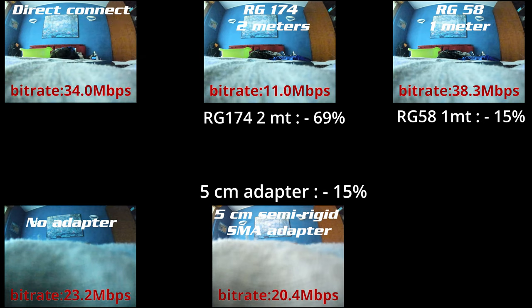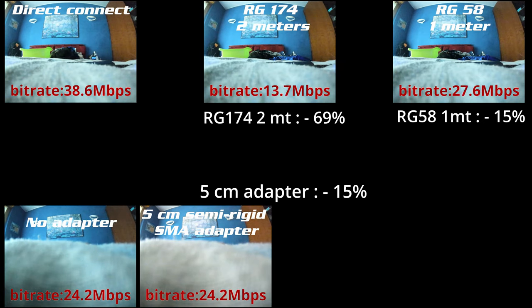On the other hand, when using the two meter long RG174 cable, the signal loss dramatically dropped and it was nearly minus 70 percent, which is totally unusable. So long story short, if you want to try something similar with a fixed ground station, be sure to get the best quality extension cable you can — short, one meter, no more, gold plated, double shielded — everything that can help you keep your signal loss at an acceptable rate.